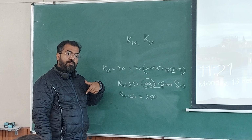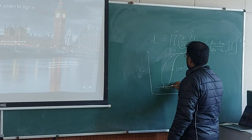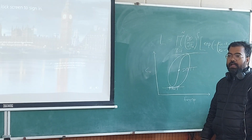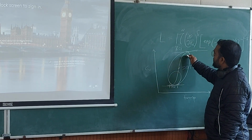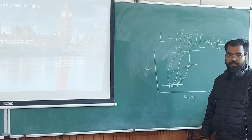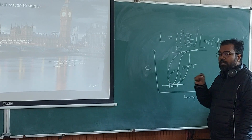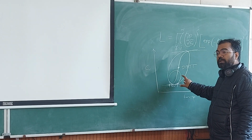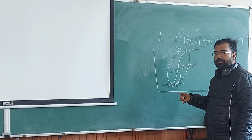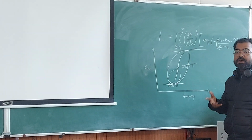And the next thing is, if you do a lot of testing at the upper region of the transition temperature. This is the transition regime, in between this and this. If you follow the master curve, then all the data must be created in this region, and all the data here will be censored. So if you are doing a test on a smaller specimen, the idea is that you need to have an estimate of KJC before doing the test, so that you don't fall in this region. Because how will you decide at which temperature to do the test?